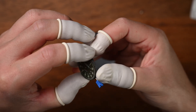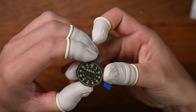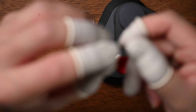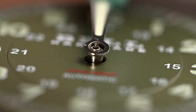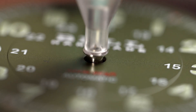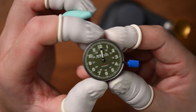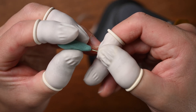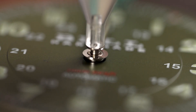Another thing to note is that I left the date wheel complication on this movement. Leaving that date wheel on isn't going to have any functional effect on the watch, but realistically I should have removed the date wheel or used an NH38 movement. But now that we've got the dial fitted, we can go ahead and start setting our hands. Our first hand is obviously going to be our hour hand. I did set the movement to 12am because the date wheel is still there — I just rotated the movement over in the time setting position until the date wheel clicked. Then I can go ahead and set the hands at 12 o'clock. In between setting each hand, I like to rotate the movement over two times just to make sure that the hands operate properly and clear anything on the dial. But in this case we've got a dial with printed indices, so no clearance issues to worry about.